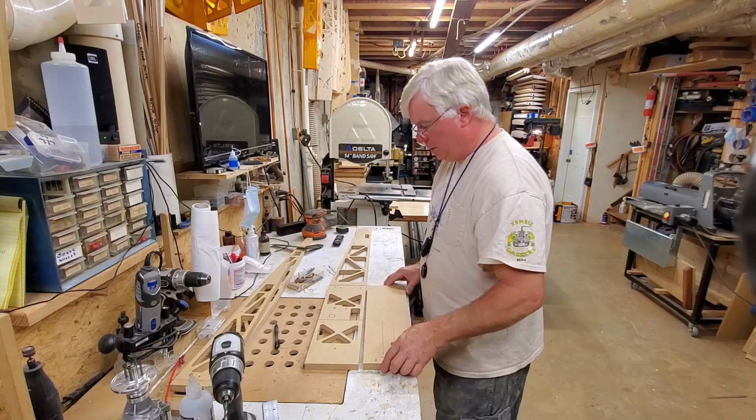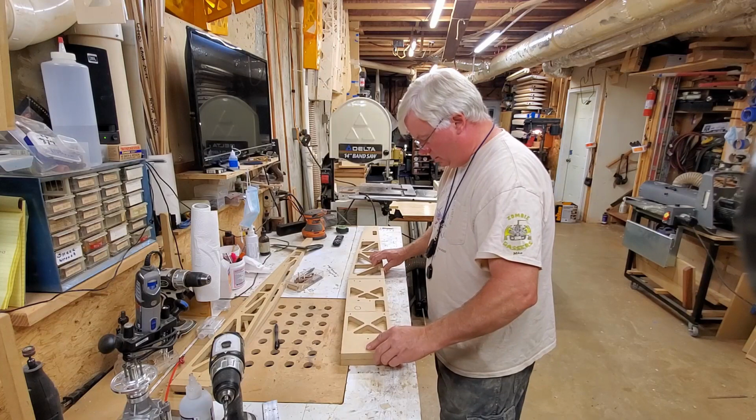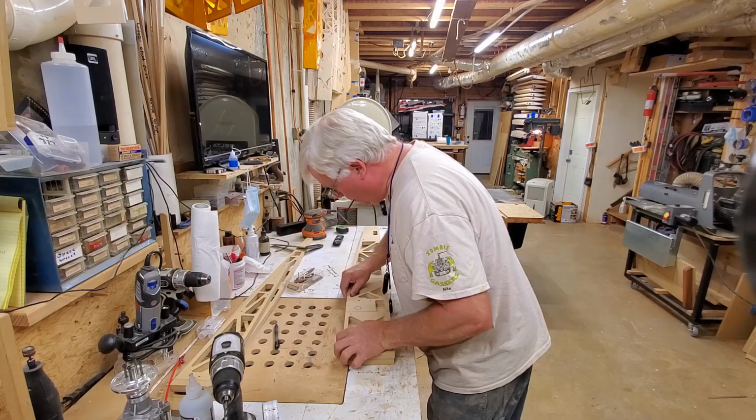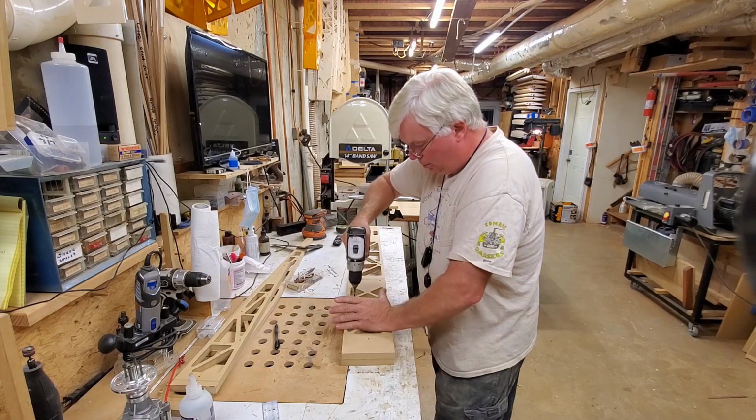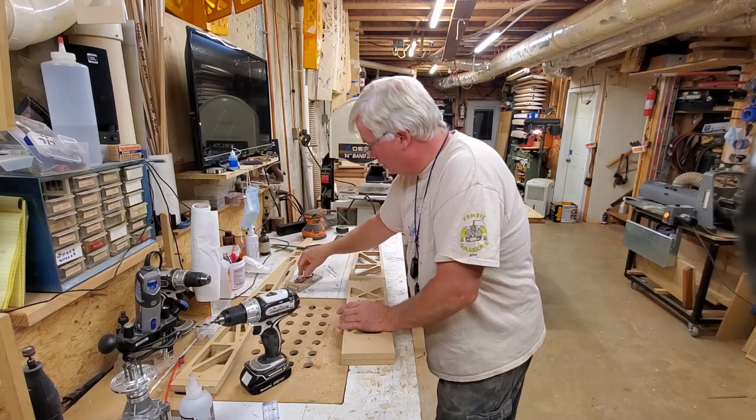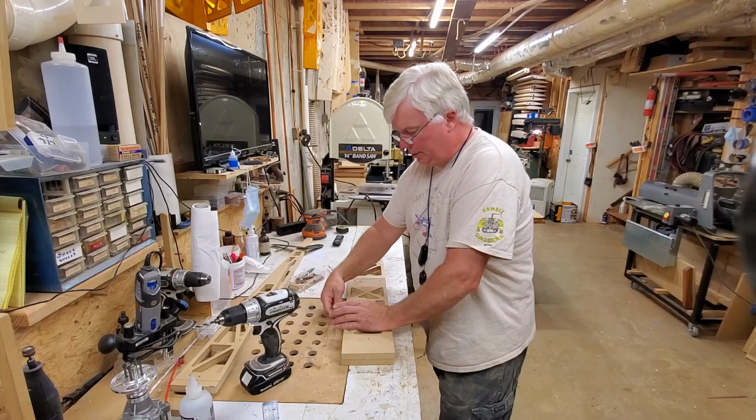But what we need to do now is cut the lightning holes out. So I will line this piece up exactly along the top and the bottom and the front. Take my 3/16 drill and drill some alignment holes. Let's drill this one first. Ooh, nope, that one, because it's on top of me. What I realized there at the last second is that I didn't have my backer board, scrap board, down there, and I'd rather drill a hole in this than in the table.